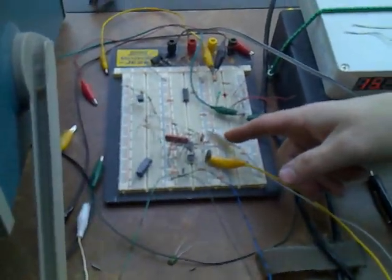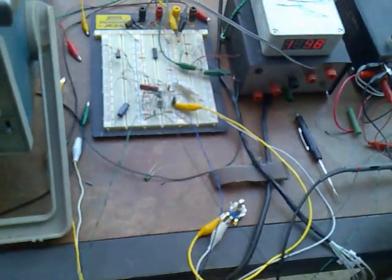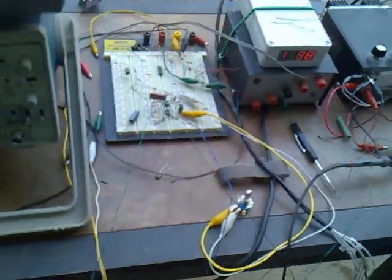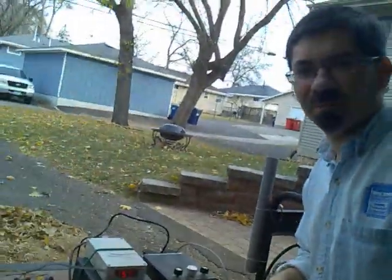I feed that and clean that waveform up into a nice square wave, which is used to trigger a monostable oscillator, which then, using this potentiometer, I can control the exact width of the injector pulse — basically from approximately one and a half milliseconds all the way up to whatever is necessary to fuel the engine.